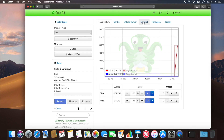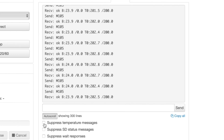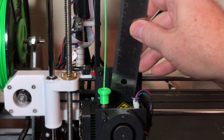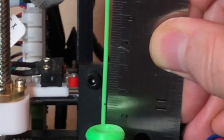Once that's up to temperature, click on the terminal tab, because to extrude the filament we're going to be manually sending G-code to the printer. Check the box to suppress temperature messages. We need to make sure the extruder is set to relative mode, so type M83 and press return. Then to extrude 100 millimeters of filament, type G1 E100 F100 and press return. This tells Klipper to extrude 100 millimeters of filament over the course of one minute. When it's done, measure where the mark is — it landed at 23 millimeters, so we're under-extruding just a little bit.